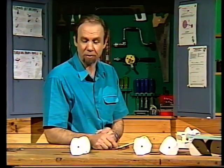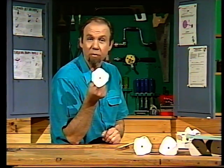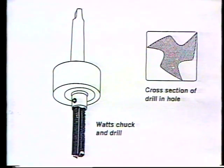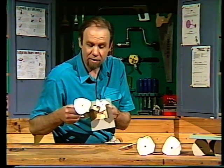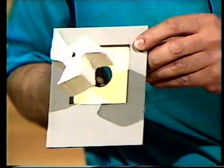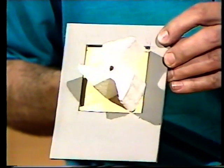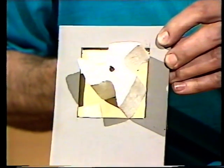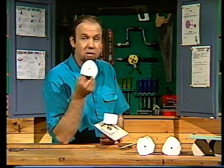And so the platform gets a very smooth ride until eventually it runs out of rollers — and that's how they work. These are a very peculiar shape and they've been used for a variety of objects. One of the most extraordinary is a drill that drills, believe it or not, square holes. It was actually manufactured — the Watts Chuck and Drill. The drill not only spun around, but it went in a sort of eccentric movement like the planets around the sun. You can see the basic shape of the triangle in it, but the drill's been chewed out on three sides to make a cutting edge. As it spun around, it also moved in a circle, and doing that it cut into the timber, literally drilling square holes. Doesn't sound possible, but it was manufactured and sold. So there you are — triangular wheels: not as silly as you might think.